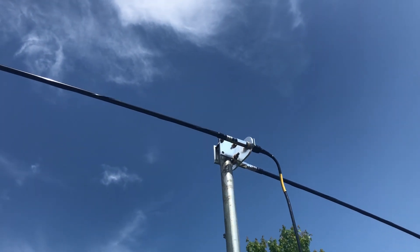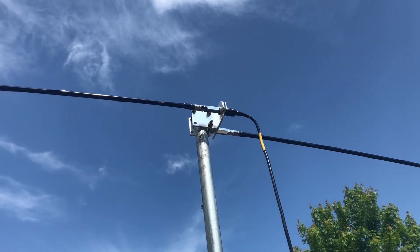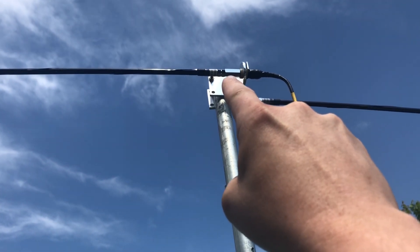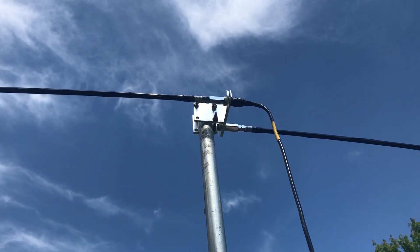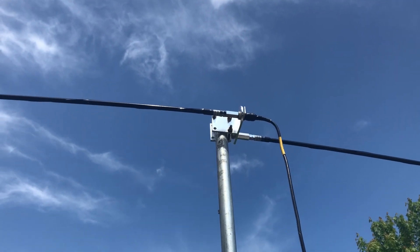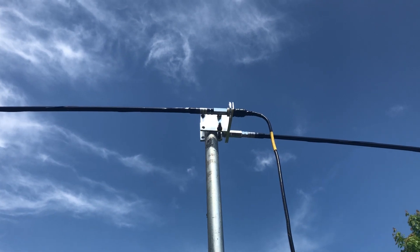That's because when I started putting it together I ran into a problem and left it half-done for about a month. That thread connector was made wrong — it wasn't threaded all the way. Somebody fell asleep at the switch during manufacturing. I had to get a tap and finish cutting the threads, which was a huge pain. I had to do it with a pair of pliers and a vice, but it worked.